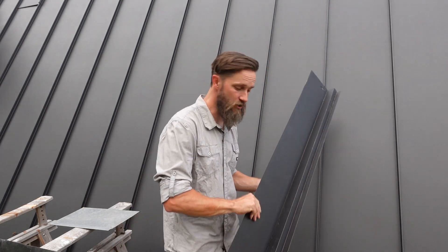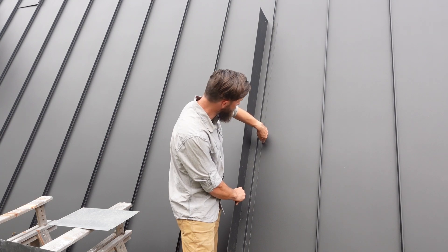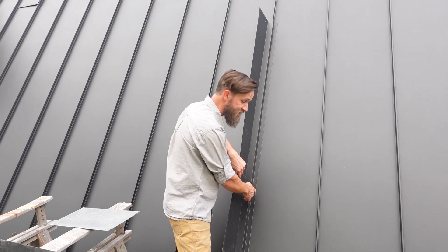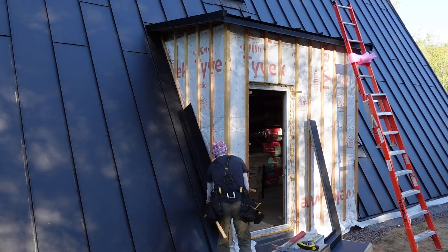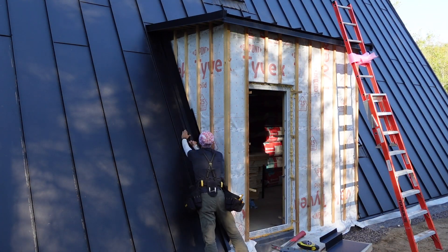The second thing I want to talk about is what happens when you come up to a dormer wall on your house. This is the sidewall flashing that goes up against the dormer wall. You want to make sure that when it sits on the roofing it gets nice and flat and tight, and then you screw it down really tight so that water, ice, and snow can't get between the steel and the sidewall flashing. Once installed, your siding then goes over top of this piece of steel so that water can't get in behind it and it protects your roof line.